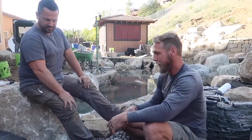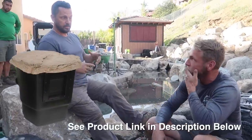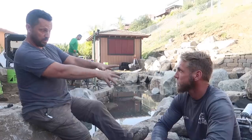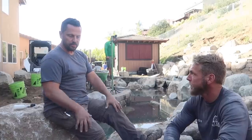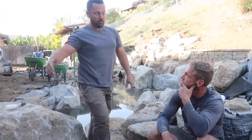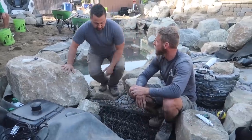It's day eight. Help me understand what this is — it's a skimmer on steroids, essentially. Most of the ponds you build have skimmer boxes like the Aquascape Signature 1000, and that would work on a smaller pond without all this other stuff going on. Because we have an urn, a wetland filter, a big waterfall, jets, and the feature behind you — we're running four pumps in this whole system. It wouldn't make sense to put a small skimmer box here, let alone two skimmer boxes. This is a great alternative when you're moving a lot of water with multiple pumps. It gives more surface area and is a great collection area — when finished there'll be about six inches of water in here, making it easy for a homeowner to come out with a simple skimmer net. It'll be a five-second maintenance thing.